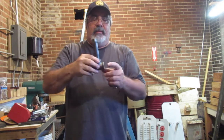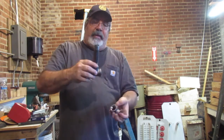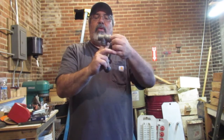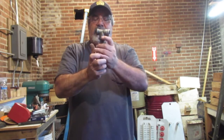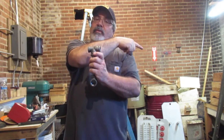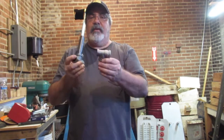All right, then we're going to come out and go down right away, and that's going to go over to Dean's shop. Then I'm going to put this T on here. It's 3/4, 3/4 and 1/2. So this will go on this way. All right, so we'll put the 1/2-inch line over there for the core table, and this is 3/4 over to the main.